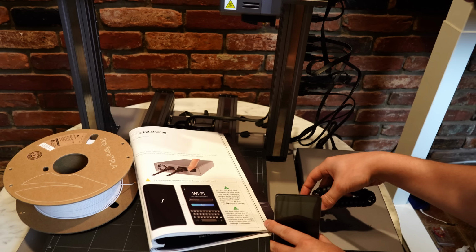I guess one thing that they might be concerned about is if you loaded G-code onto this machine and someone just fired it up and tried running something, you really might run into an issue where you're running G-code for the laser cutter or the CNC head, but you've got the 3D printer attachment on there and it could mess some stuff up. So you definitely gotta be a little careful making sure that you run the right kind of G-code on here. I just realized I did something wrong here.